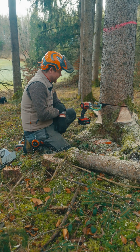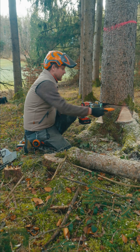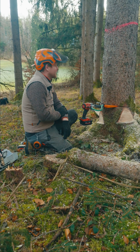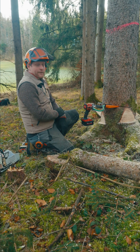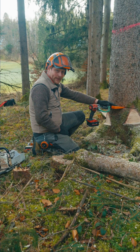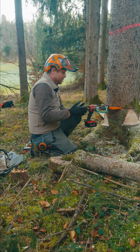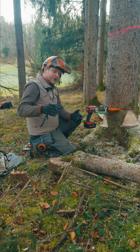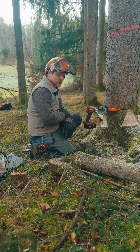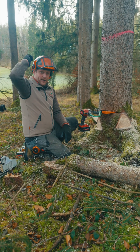For safety reasons, a regular wedge can save the tree if everything goes wrong. The final cut should be placed a little upwards or downwards of the metal wedge, because you cannot let your chain contact the wedge. As the wedge is made of metal, this can harm or damage your chain very badly.